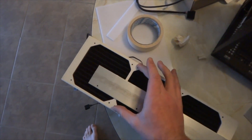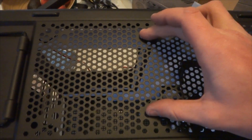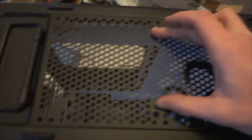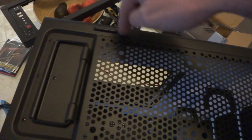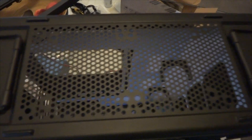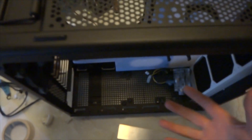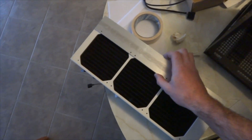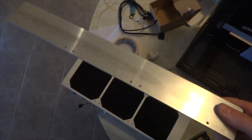Rather than have to have the holes 120mm wide — because the 120mm holes are in the middle of the grill up here — what I'll do is have those brackets mounted on the radiator and then drill holes along the top here at different spacing. I'll drill holes in this and tap them M4, so hopefully once that's mounted we'll just be able to lift it up. The holes will be drilled, these will be painted white.